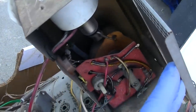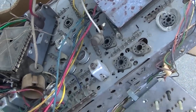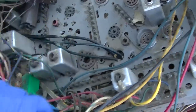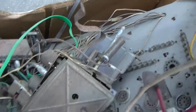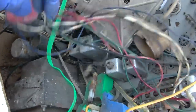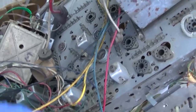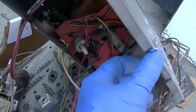The only tube left in there is the high voltage rectifier and there's no chassis number, so the first thing we need to do is identify it. Most Zenith had controls sticking out the front of the chassis; these are on a separate control assembly. Big problems with these are vertical output transformers failing. The flybacks are pretty reliable, except the components on this board - these boards like to become conductive and arc out, but that's easy to fix with a Dremel.